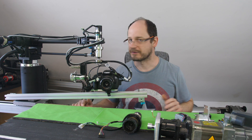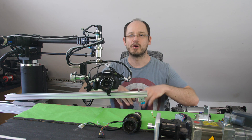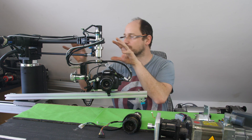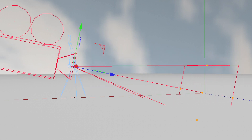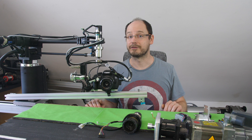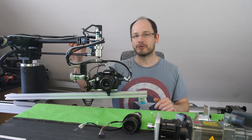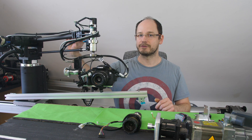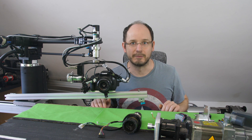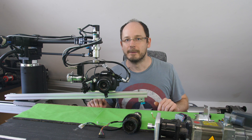So that's all six axes. I like this structure — it's a kind of traditional camera crane, because all 3D software like Blender has the possibility to place a crane and if you know all the angles of all the axes you can import the motion and get the same camera movement in software as in real life. It's quite flexible: you have motion up and down, closer and further to the target, pan, tilt, focus change, and linear motion — really useful when something is moving and you want to follow it.